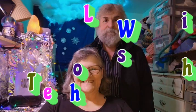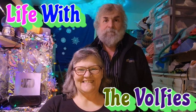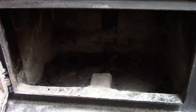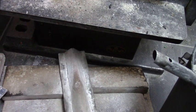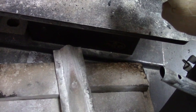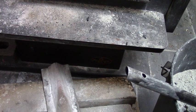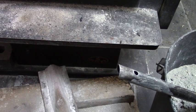We're going to clean the wood stove today and the chimney. I took the bricks out of up top — the center piece and the other bricks that line the top. I took out the bottom ones, cleaned out the ash, and then I'm going to go up the roof and drop my cleaning ball down it. I'm lucky because I don't have a flue and I have a straight pipe — very easy. If you had bendy pipes, you'd have to take them down and clean it.